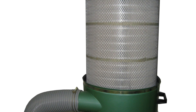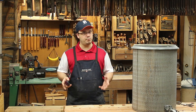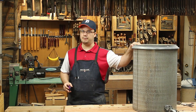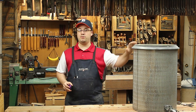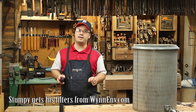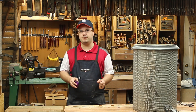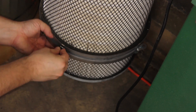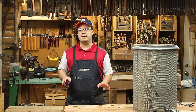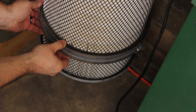Would a filter upgrade make a difference in your dust collector? Absolutely. If you have a bag filter, upgrading to the right cartridge will dramatically improve the quality of air coming out of your system and give you a big boost in suction. If you already have a cartridge-style filter, you may still want to consider upgrading to a nano filter, which is significantly better than older ones and can increase both fine dust filtration and airflow. For cyclone setups, there's also a small filter for the bottom that replaces the clean-out box — it clips on with separately sold clips, catches fine dust in a pan, and adds another 30 square feet of MERV 15 filtration.